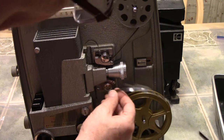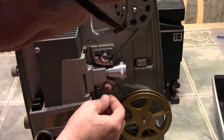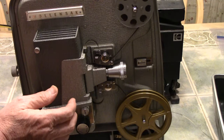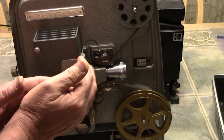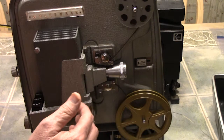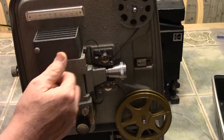This loop up here is very important, as is the one down below. There has to be a loop on both sides of the film. It shouldn't be ridiculous — just enough room so the film can bounce up and down. Why does the film bounce? Because as it goes through the gate, a claw comes out and pulls the film through one frame at a time. It brings it up, opens the shutter so light can shine through, then closes the shutter and moves to the next frame. So you only see a single picture each time. This loop keeps that little gap for the film bouncing up and down inside the gate. If it were too close to the gears, it would rip the film badly. Always remember to do that loop.